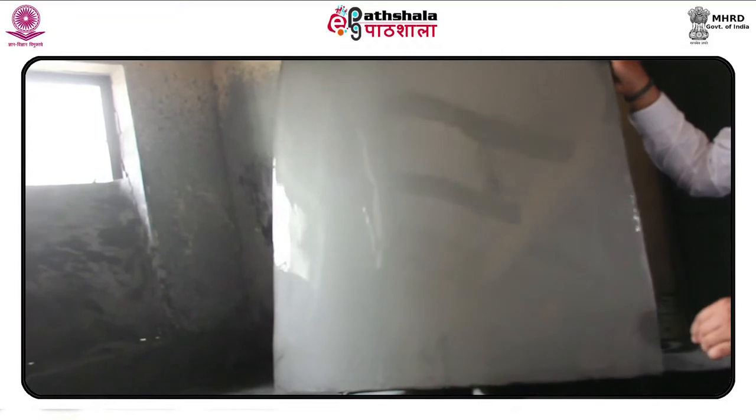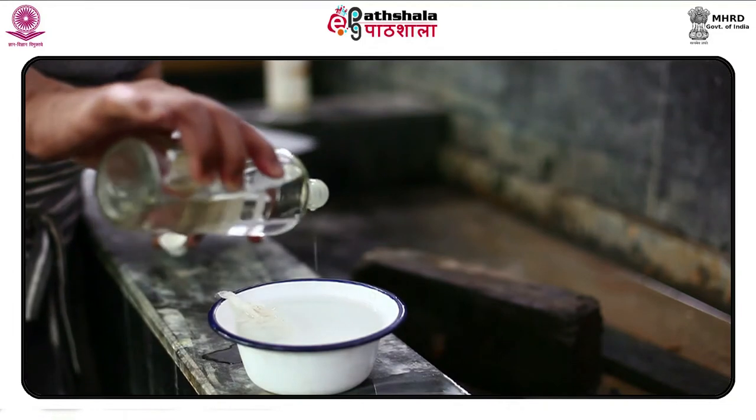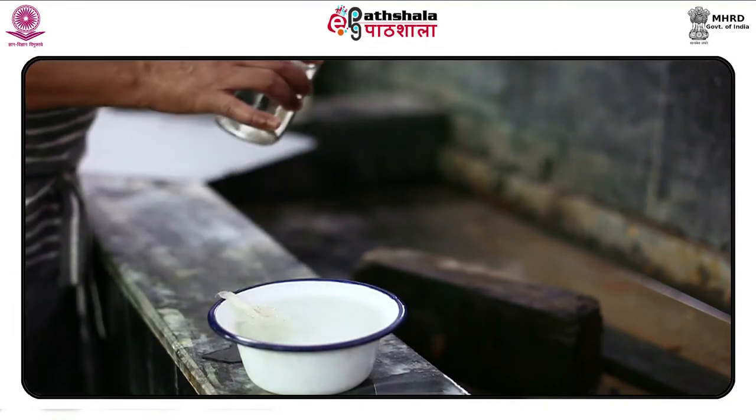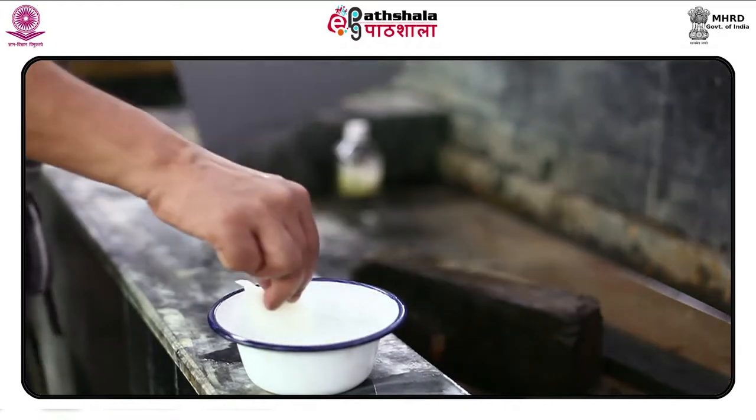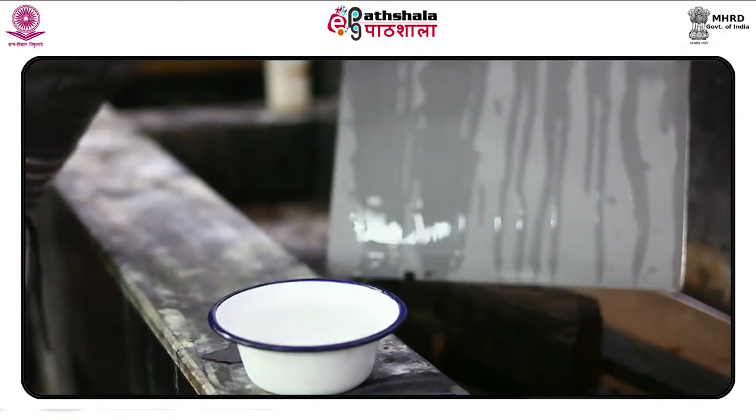The final aluminium plate should be with rough or medium grains. Add a few drops of phosphoric acid to hot water and, with a cotton rag, clean the surface of any grease. Instead of phosphoric acid, alum can be used to clean the plate. Dry it immediately to avoid oxidation of the plate.